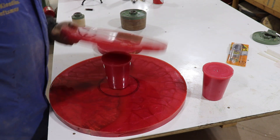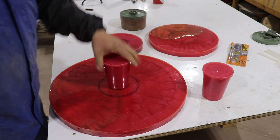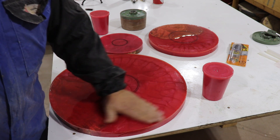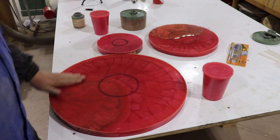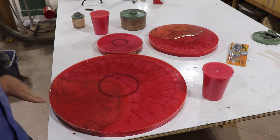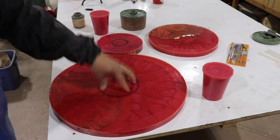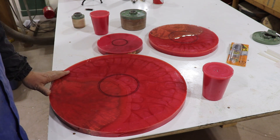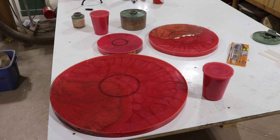I'm going to get some hot glue on this — start with the base. Because it's resin I'll be using a full face respirator, so there will be no chatting during turning — I'll have to voice over it after the fact. I'm going to mount this with hot glue, put a bead around the outside, then put it down on the lathe.